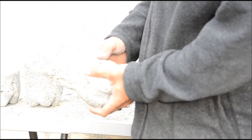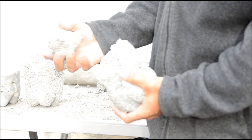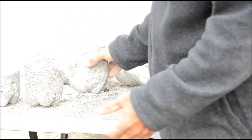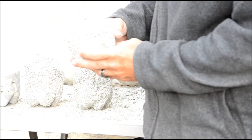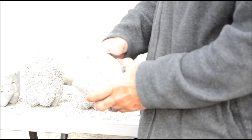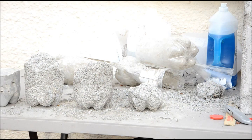It's not much better with 50 parts to 1 — this is 50 parts water, one part soap, and it's still crumbly cement. Again, this was mixed by hand, not through the machine. The last one I did was thinking less soap solution would be stronger — 100 parts water to one part soap — and still the same crumbly cement. So far I haven't had any luck with a nice solid block.